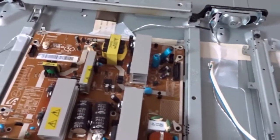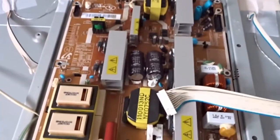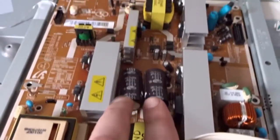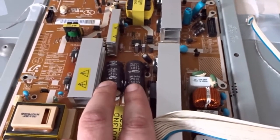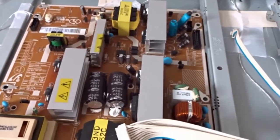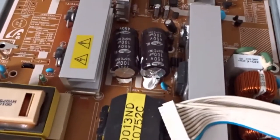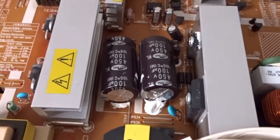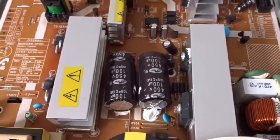If the set powers on when you apply heat to the capacitors, then that is the problem. These two other caps check borderline good. I've got two on order from Germany, which should arrive in the next two or three days. For now I'll leave those two in — they're an easy snap-in replacement anyway. They're 450 volts, 100 microfarad — two big filter caps. They're going to be replaced, but for the time being they will get the set up and running, though they are marginal and will have to be changed.